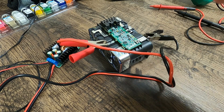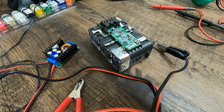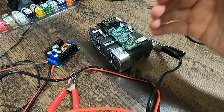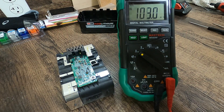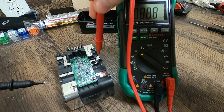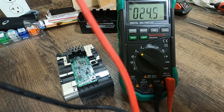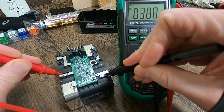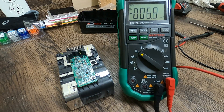To fully test this, we need to take our power leads off and let it sit overnight. We'll recheck both cells we charged up to make sure they hold the charge. 24 hours later — we've waited 24 hours: the readings are 3.94 and 3.88. They may not have charged quite up to 4 — we may have taken them off a little early — but they've held the charge overnight, so I think we're good to go.